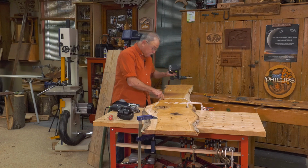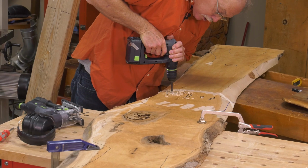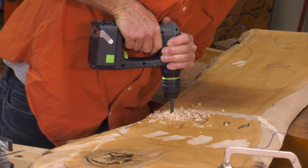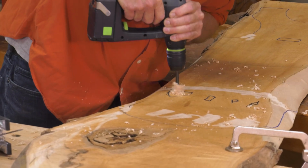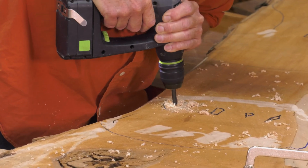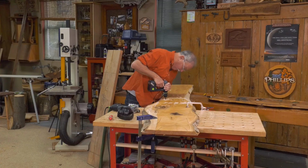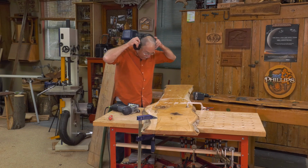And also these pierce cuts, we need to drill holes using a Forstner bit, and you want to cut out, you don't want to break out. Give that bit a chance to carry away the sawdust. And this maple is just 1 3/8 inches thick. So let's get through there. Daggone it, there we go. Whew, boy, that's tough stuff. Exactly what I want for the backboard.